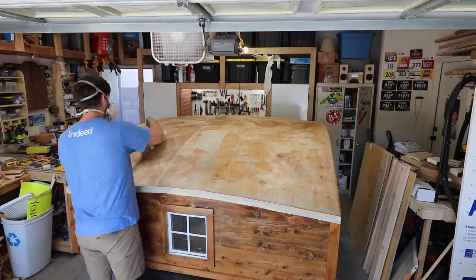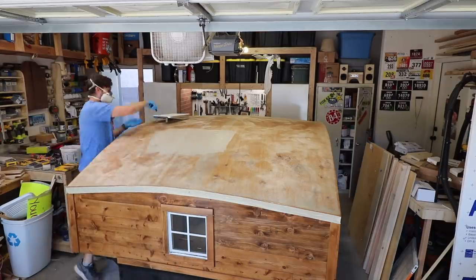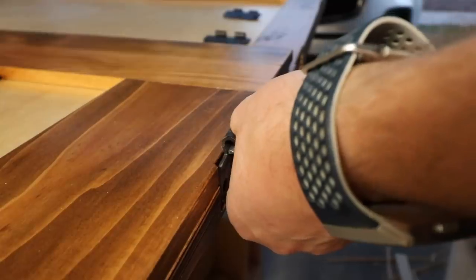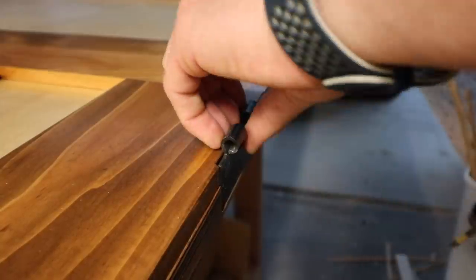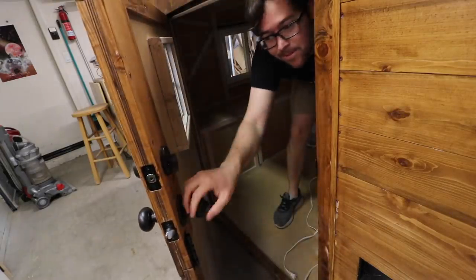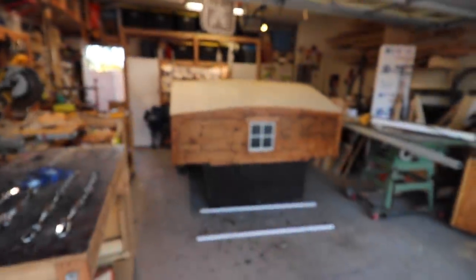Once the roof was completely dry, I followed it up with a gel coat of paint — marine grade, waterproof, just adding another layer of protection to the roof. I then covered the camper and the door in a protective layer of polyurethane, and it was time to reinstall all the hardware: hinges, doorknobs, handles, locks — everything needed to keep the camper secure and safe at night.